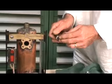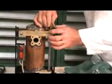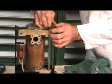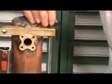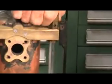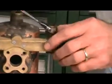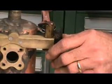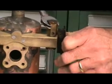We've started using these thick Teflon washers for this position. This is the pressure safety valve, and I really like this one. It replaces the copper crush washer, and that washer is sometimes so hard to get sealed. But this one, you just take it, and it's just like butter.